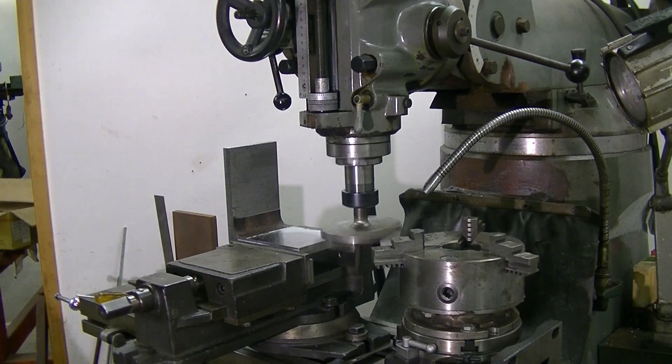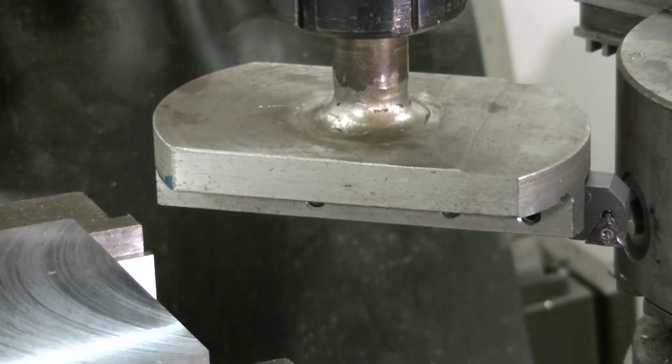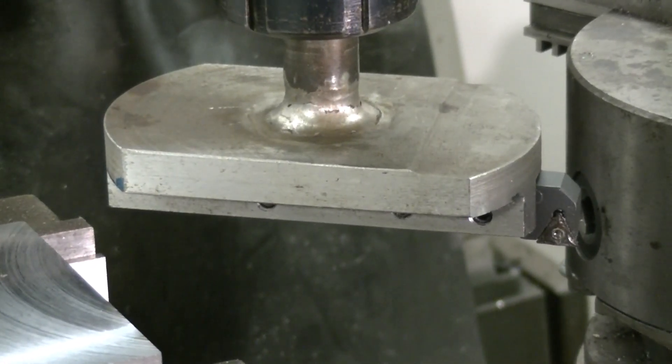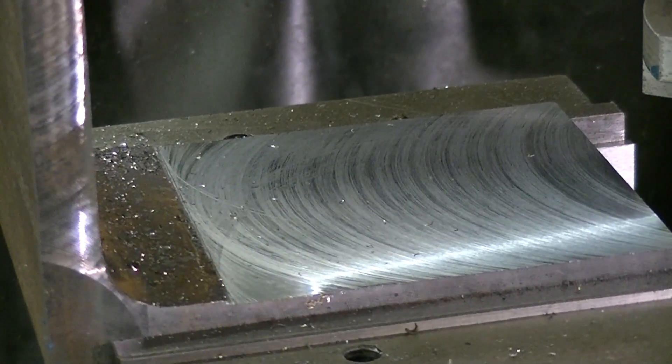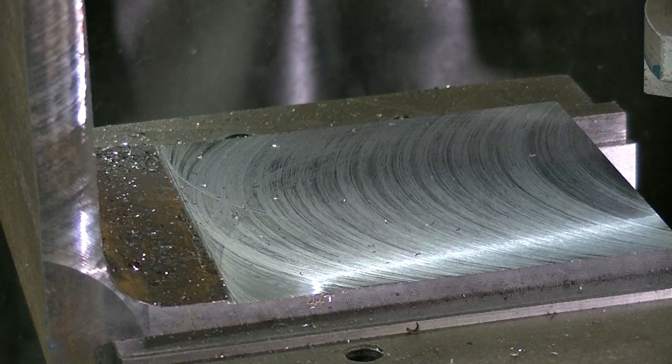Run a few more passes on the noisy old belt and I'll bring you in to look at the finish. Here's a close-up of the left-hand turning tool in the fly cutter. I think the success is because of the extremely small radius on the insert — it's only a 0.04 radius. Skimming it across the plate, total removed was about 7 thou. The scratchy surface is due to me retracting back across the work without any cut or load on it — the insert just scratches rather than actually cuts. But I'm pleased with that for an angle plate for the borer; it'll do quite well.